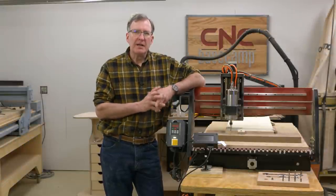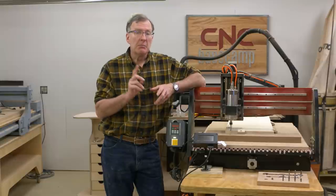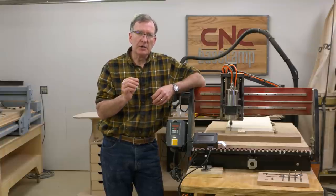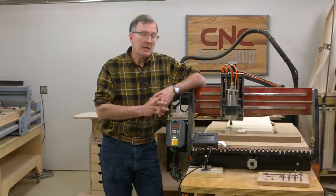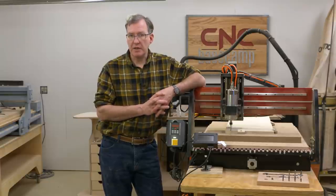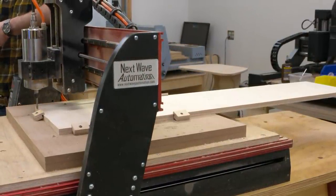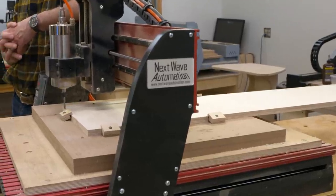We just finished our bench and it was built using a 4x4 foot format machine, which is great if you've got it. Most of us probably have more of a desktop machine, but don't let that limit you. If you use the feature of tiling, you can create large furniture projects and all sorts of things with a relatively small machine. What we're going to do is a little test piece in which we'll cut the crest rail of our bench on a 2x2 foot format machine — and the crest rail measures about 48 inches in length total. The first thing we need to do is go to the computer and get some files made for tiling.